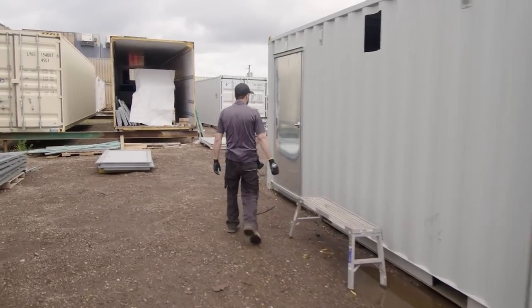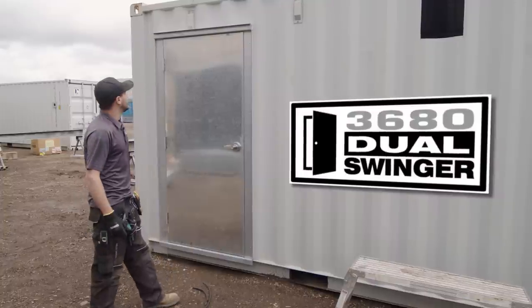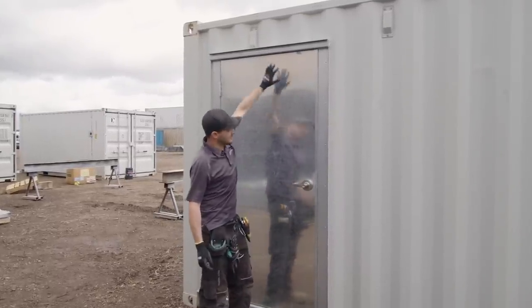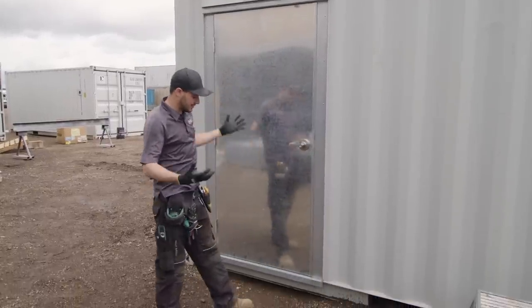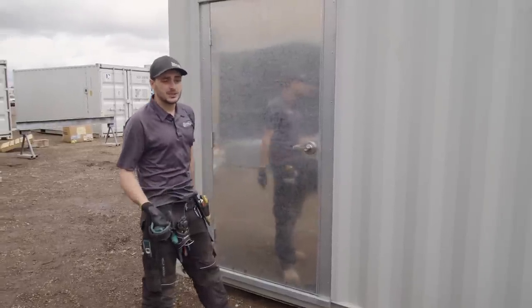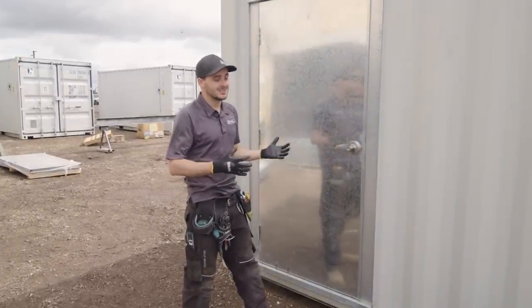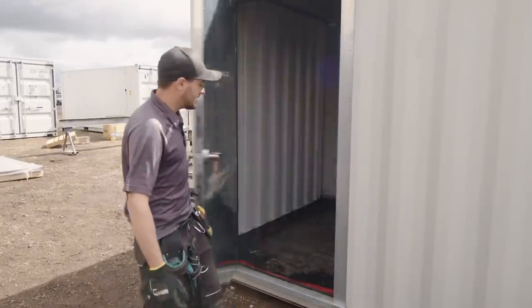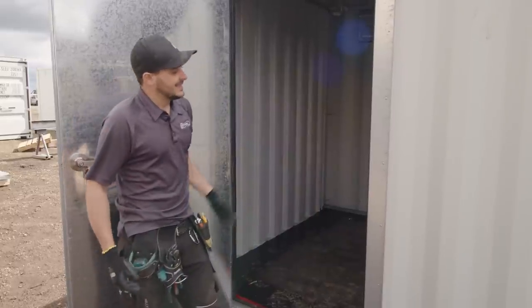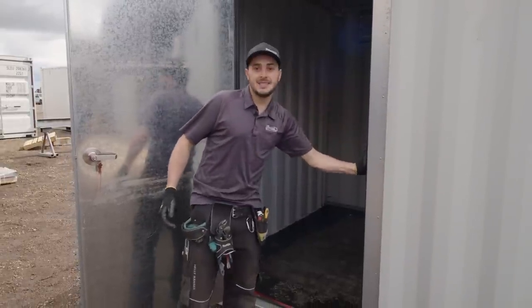This container has the Container Modification World dual swinger man door installed — we've featured these a lot throughout our channel. They work great, they've got the header with the rain drip, and it was just raining earlier and I could see it dripping nicely with nothing coming around and into the container. It's designed for containers and it kind of moves with containers. A lot of times with a North American man door, it's not necessarily the door that's the problem — it's the seal. When things shift and move, it pushes on the door seal and it stops functioning properly. These utilize an automotive-style side bulb seal, just like the trunk of your vehicle, so it moves with the container, can pop right off, and install back on, keeping everything nice and sealed up.